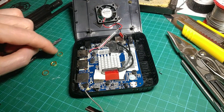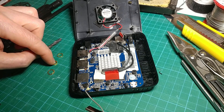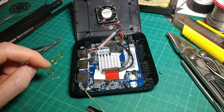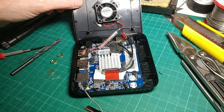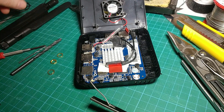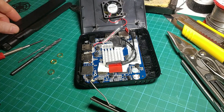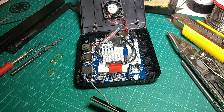When you finally put it together there are a couple of washers — I'm going to put the crenelated washer on the inside of the case, and the split ring lock washer goes on the outside next to the nut. I decided to put it on the lid because I tried putting it on the side on a different box and it sticks out downwards due to the angle. I've got a couple of aerials to try: an 8 dB dual-band one and a huge 18 dB 2.4 GHz one. I want to see whether that also picks up any 5 GHz stuff.